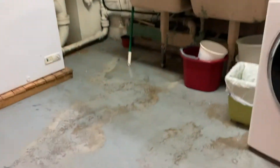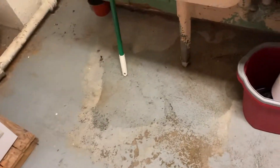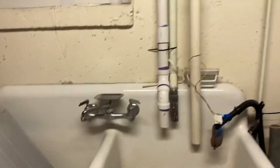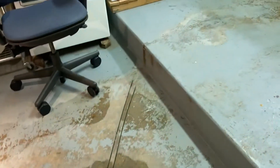This system has been working pretty well. Water comes in from this wall — there used to be a drain in these window wells but it doesn't work anymore; snaking it out is useless. Water comes down through the foundation, so the easiest fix without making a mess was to cut two little channels into the floor. Those channels are actually working pretty well, channeling water into the sump pit. This is the lowest spot in the room, so water naturally gravitates here anyway.